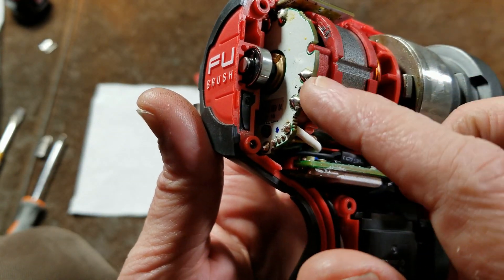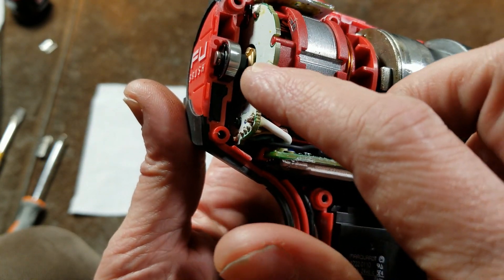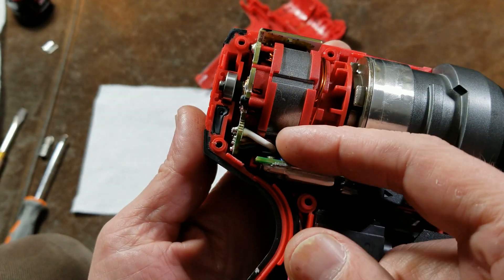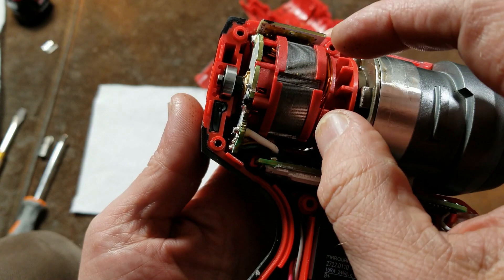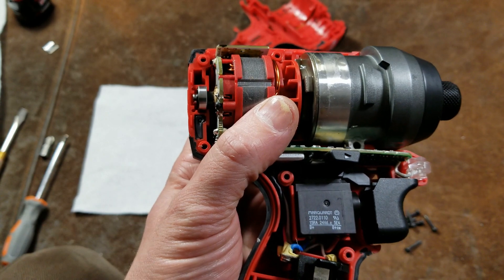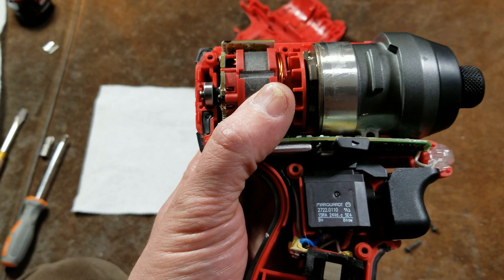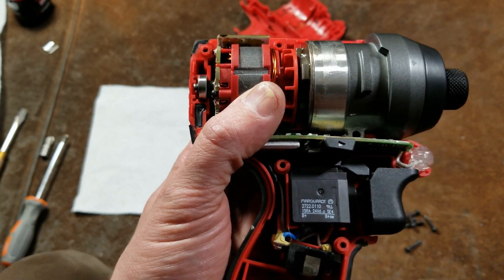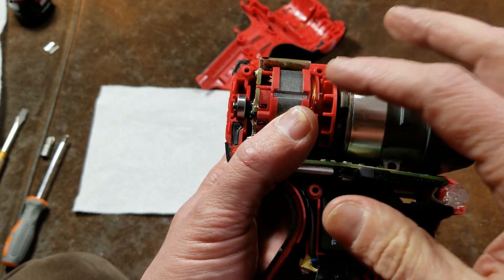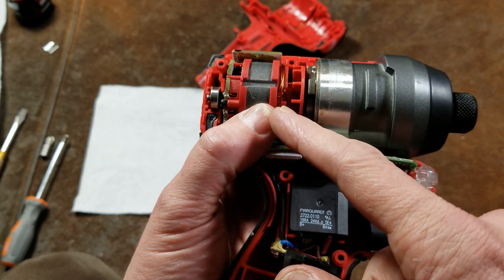This circuit board has three Hall effect or magnetic sensors, and there's a little magnet in that brass piece. As the motor spins, it knows exactly what position it's in so it can activate the fields appropriately. This is known as a sensored brushless motor. There are sensorless ones — that's what drones use, because drone motors don't run at low speeds and don't need a lot of torque at startup. They just start spinning fast and govern themselves by the computer speeding up or slowing down the switching of the coils.